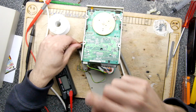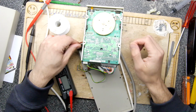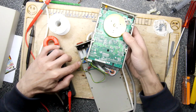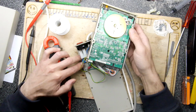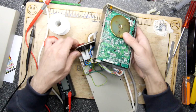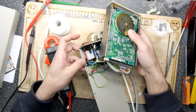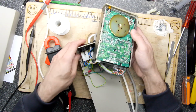I got it flipped open, and I basically had a little wiggle of all of the connectors and solder joints, and the thing was working. There was power. The 12 volts and 5 volts is there. So you've basically got a 7805 here and a 7812 right here next to it. So those are doing the regulation for the drive. So it's really simple. They're the only two in there. You can just swap those out. Measure it's normally input, ground, out pin-wise. So check the volts on those. If you don't have 5 volts from this one or 12 volts from this one, just literally check the inputs and swap them if they're in tolerance.